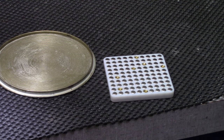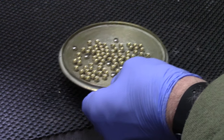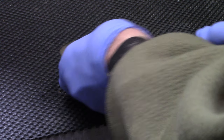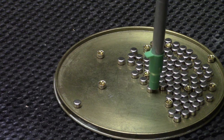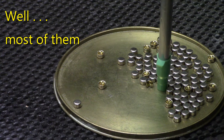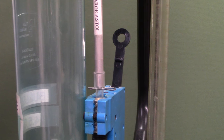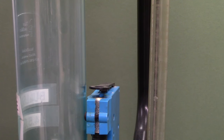Carefully slide your primers out of their box. Cover them with a plate with ridges, then turn the plate over. Notice some primers are anvil up, some anvil down. Gently shaking the plate back and forth will turn all of them the same way, which will allow you to inspect them to make sure that each one has an anvil. Then turn the plate over and they'll all be facing shiny side up. Push them and they enter the pickup tube. Be especially watchful that you don't pick up a primer that is anvil up. Turn the tube over, pull out the cotter pin, and allow the primers to drop into the machine's primer holder. Put the pressure rod back in place so gravity will help them feed.